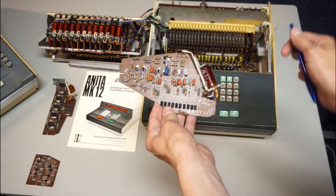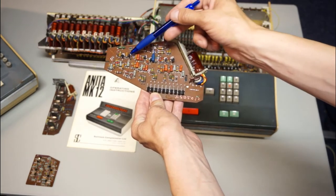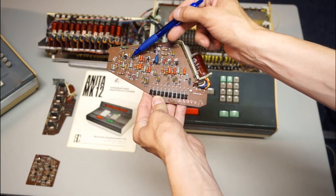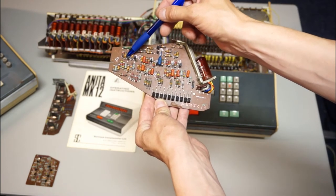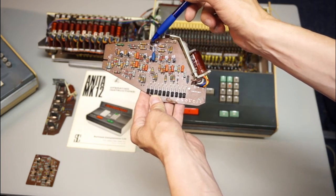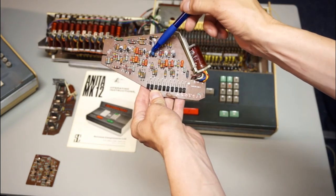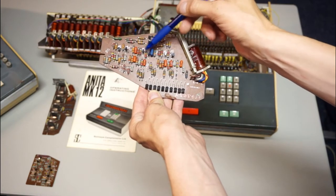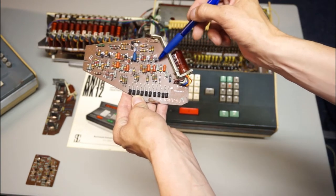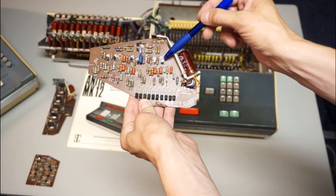The Mark 12 — well, you can see there are no trigger tubes on it, but there are transistors. In groups of two there are flip-flops. A flip-flop has two states: one transistor conducting and the other not, or the opposite way. This gives two states. If you have another set of transistors, two states times two states is four states. Add another two transistors and four states times two states is eight states. That still isn't enough to store zero to nine, so add another two transistors and you have eight times two — sixteen possibilities to store a number in the card.